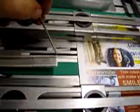Now, by using a 1/8 inch T-handle, I mean a 3mm T-handle, you have a small screw right down inside there. You'll see it. You loosen it, and then just nudge your back jogger forward. Then resecure the set screw, and now you've set your back jogger.